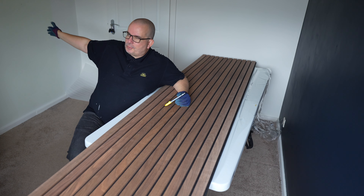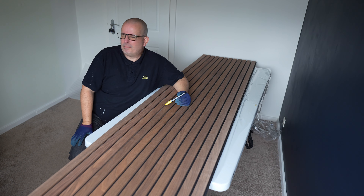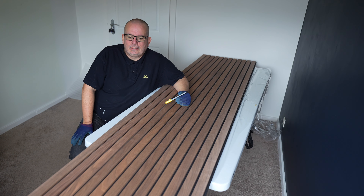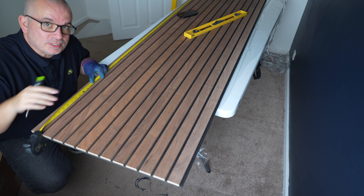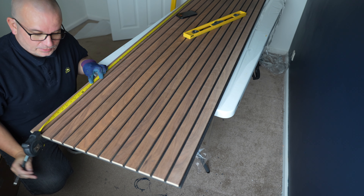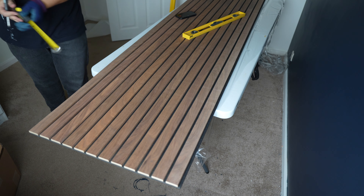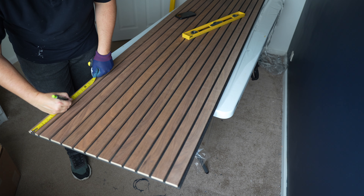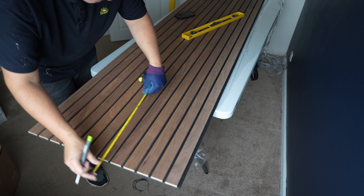You want a really fine tooth blade so you don't destroy the wood as you're going through it. I was originally going to cover the entire space, but I've decided three panels wide will leave about this much of a gap at each side, which I think might look better. I'm also going to put some on the back wall afterwards. The panel is 240 centimeters long and my wall gap is 220 centimeters, so I'm measuring back 20 centimeters from the end and marking it.